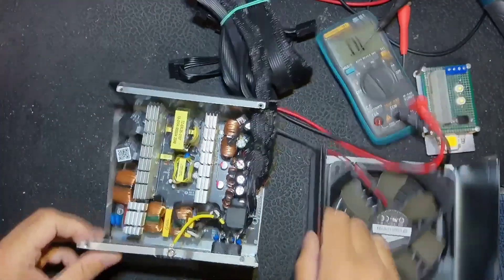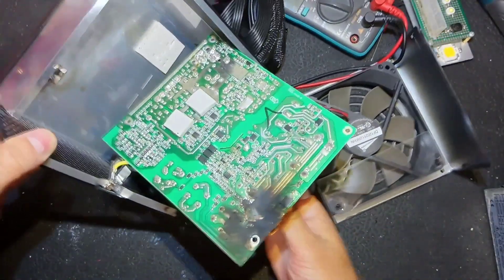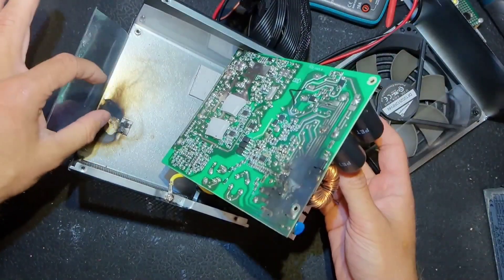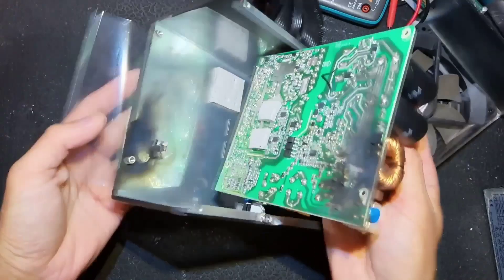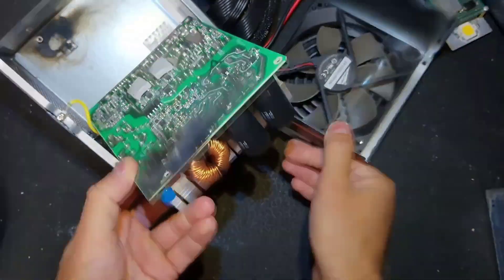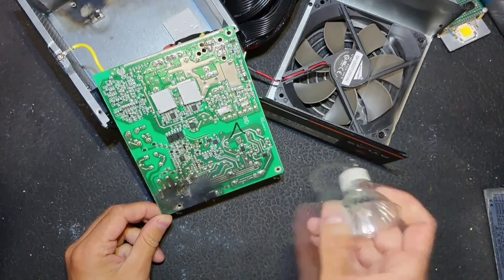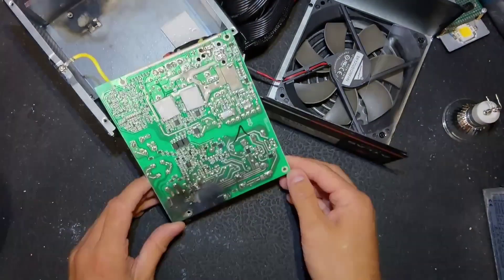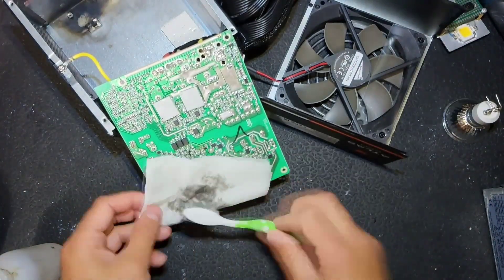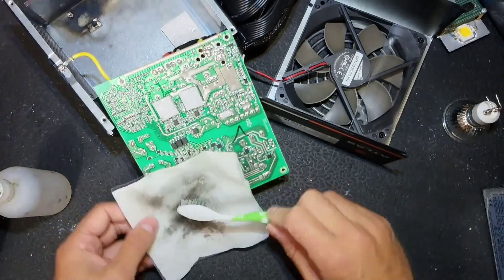In this power supply that line is fine, so I'll proceed opening and remove the PCB with the help of the screwdriver I mentioned. Let's see what's on that side - yeah, I think the problem is clear. There was fire underneath, something burned severely. There are some pieces of current resistors, so it's definitely a blown transistor, or maybe two transistors blown, and current resistors blown as well. I make sure that there is no voltage at the bulk capacitors, because you never know. After that I want to clean the PCB in order to examine it better.